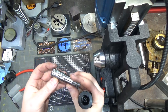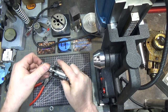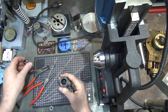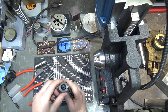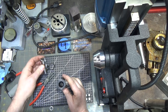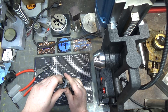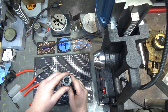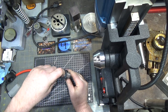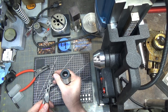I don't see any way for fluid to go around the outside of the annular cutter because it would be sitting tight against the bore. I don't really understand the spring-loaded part either. Maybe the annular cutter just slightly depresses it — let's pop this back together and see if the annular cutter slightly depresses the washer. If so, maybe they're using it as a really horrible valve design, but maybe that's what they're doing.